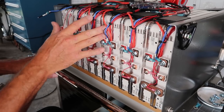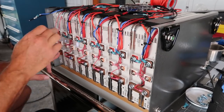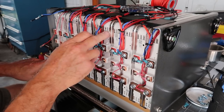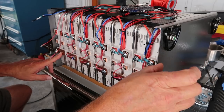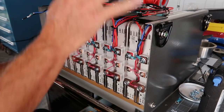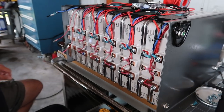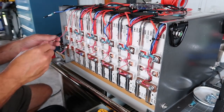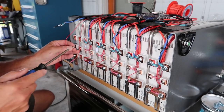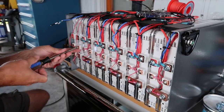In this configuration we've got 7 packs on one side, leaving 5 on the other. We will add two more, so the pack will be about that much wider, but we will have two 48-volt batteries in each pack. That's going to take us to right at 28 kWh, giving us an extra 10 kWh, and it will be in almost the same amount of space as what the Volt batteries are taking up now.